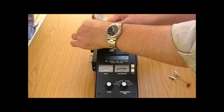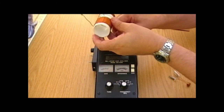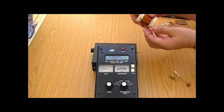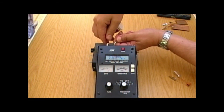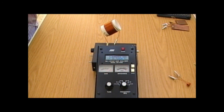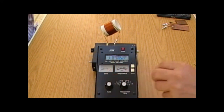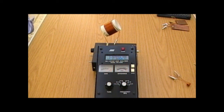We're going to change to another one. It's the same diameter but has many more turns — probably about twice as many. So more turns, same diameter; we'd expect a larger inductance again. That's reading around 27 microhenrys. It's varying a little bit, but changing the frequency on the analyser steadies it down. So the theory adds up: the more turns and the bigger the diameter, the more inductance you get.